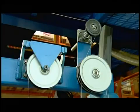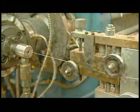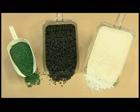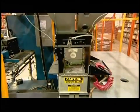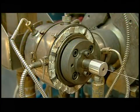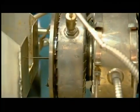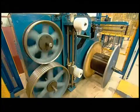An unwinding system feeds each spool of conductor to an extrusion machine. Extrusion machines force molten plastic through a die to form a particular shape. Workers load raw plastic pellets into a receptacle called a hopper at the top of the machine. The pellets drop down into a heating device, which quickly liquefies them. The machine then forces the molten plastic through a round die, forming a plastic jacket around the conductor passing through. This jacket insulates the bare wire. A water bath cools the still-warm plastic to prevent sticking as they wind up the conductor on a spool.